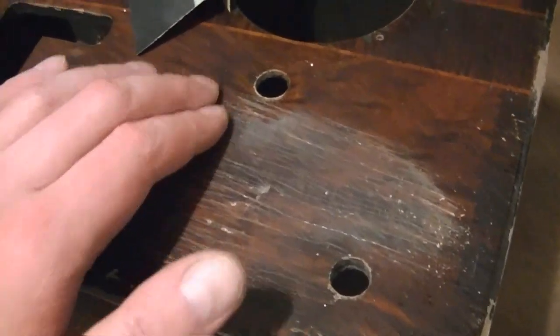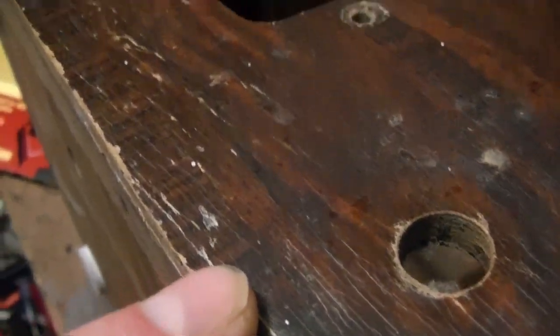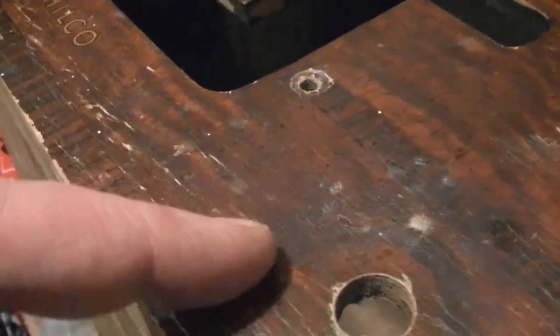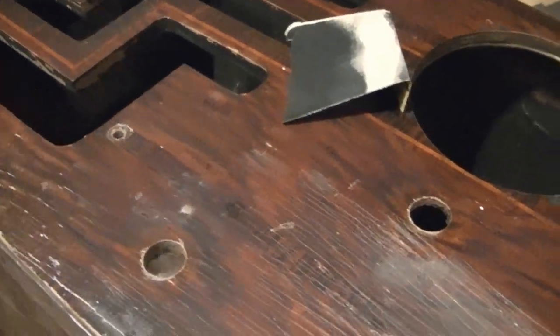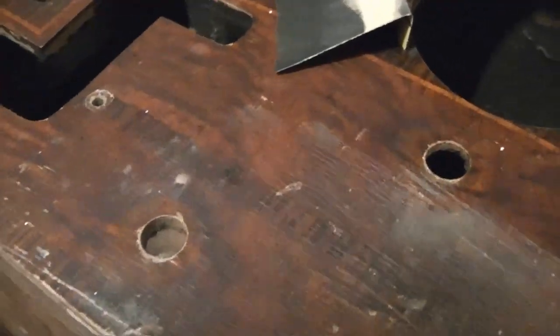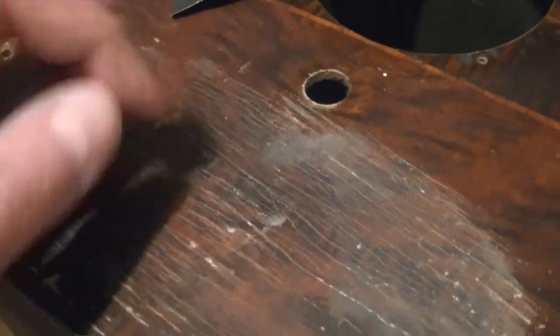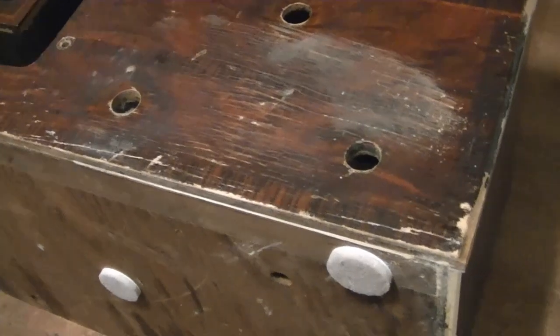The reasons I'm sanding are: one, to cut down the alligatoring a bit; two, to get off some paint flecks — there's latex paint here; and three, there are some light splotches of something — like a clear overspray of lacquer that got on this — actually raised dots. They had this stored in the garage, the seller I picked this up from, so maybe it's overspray of who knows what. I just did this section right here and it's looking better. These cracks are more pronounced now because there's sanding residue in them — of course I'll clean that off — and I have a little touch-up kit I'll show you in a moment. It has little cups of ascending colors from light tan to almost black, so I can dab those on, mix them as needed for a good color match.